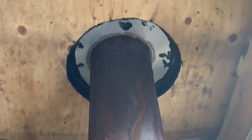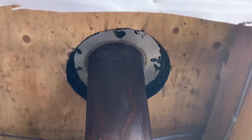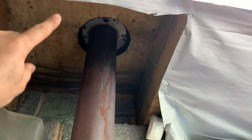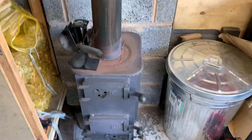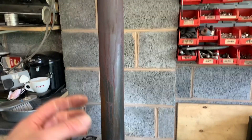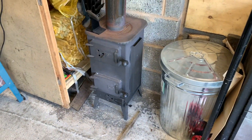Where the tube goes through that plate isn't sealed. This actually turns — I can turn this because the flue top, which is like the chimney bit that sticks out the top, is welded to that plate in there, and that plate is fixed to this and this is just pushed up. If I ever want to move the fire I can just lift this, slide the fire out and drop the flue out without going up on the roof.